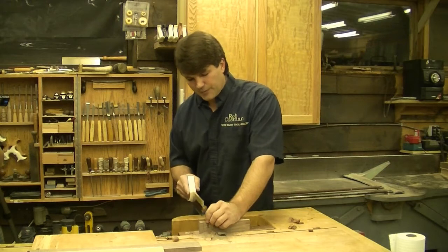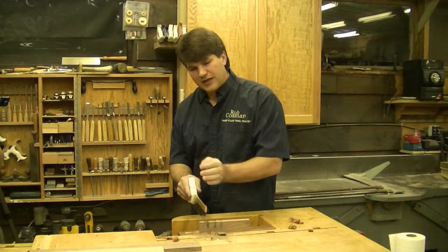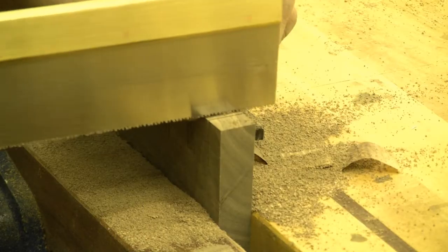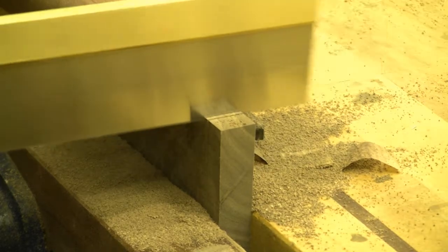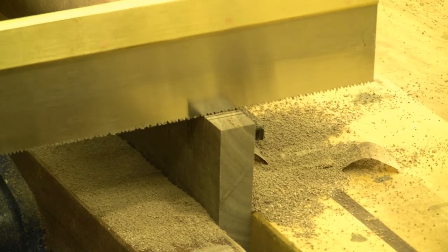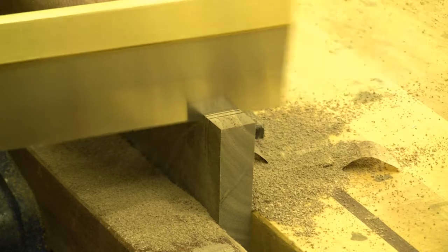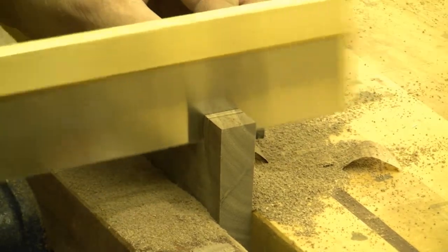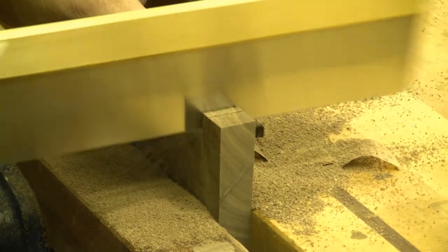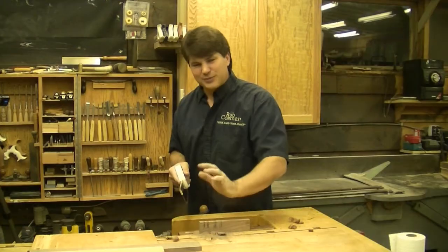Here are a few exercises you can do. What we need to develop are stabilizing muscles that will prevent any whip when we saw. A good way to do that is to make multiple vertical cuts and try to get closer and closer with each cut. That forces you to saw nice and straight from here right up through into your shoulder. Just the weight of the saw. There's nothing like using a good saw that has been properly set, properly sharp — it's an absolute pleasure.